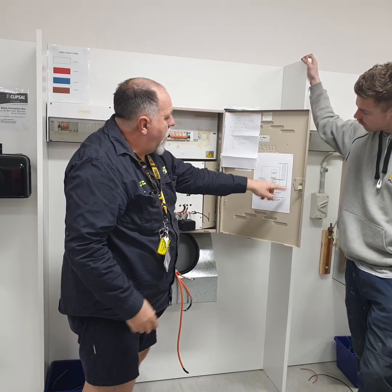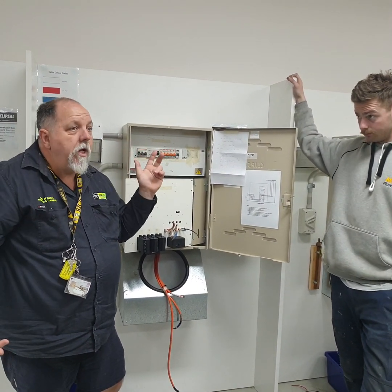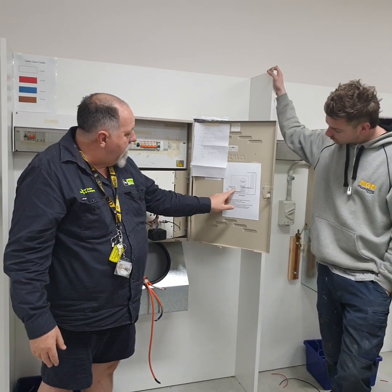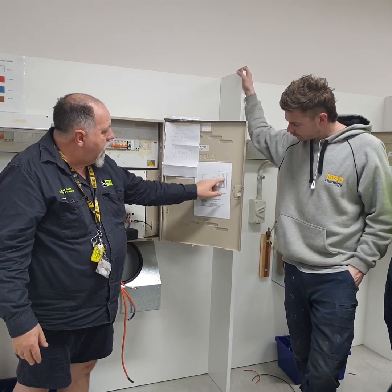This diagram is supplied. Where do I find that? We find that in the SIR book, all right, Service Installation Rules. They have all the stuff about wiring up switchboards. Anyway, you can see where the mains come in the top, line into the top, load on the bottom, we come out, and we come out with our meters.